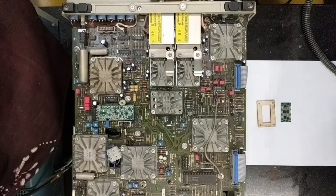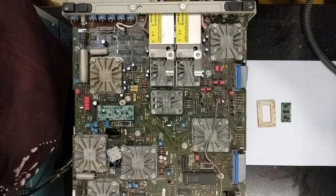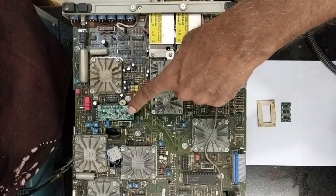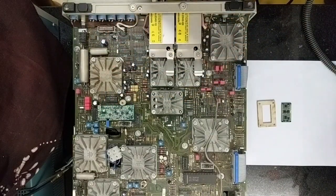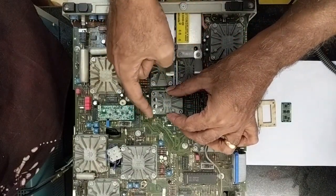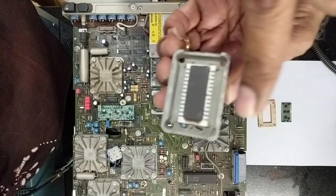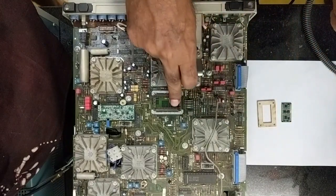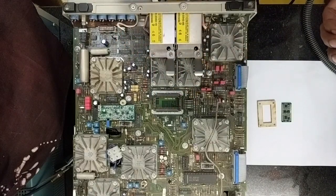What you see here is the bottom view of the 2465A oscilloscope, which has a specified bandwidth of 350 MHz. This is the U400, and what you see here is my replacement for the U800 which has been selling on eBay for a while. The U400 is held in place by four nuts, and to remove it you just loosen the nuts and out it comes. You can see there are contacts on both sides — a total of 26 contacts — and they make connections with the contacts on the edge of the socket.